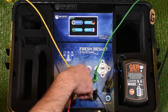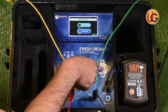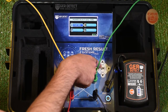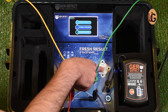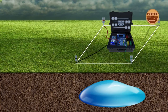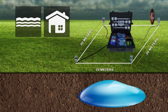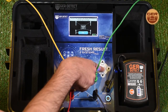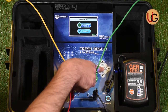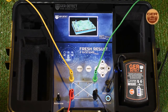Now we turn on the device and choose the search language. We go to device settings and choose the type of soil — sandy, clay, mixed, or rocky; clay soil for example. We then determine the distance between the four electrical ropes. It is recommended that the distance between sensors be 20 meters for accurate results, taking into account geographical conditions such as a house, a river, a mountain, or a fence. In such cases, you can search within 5 to 10 meters. We confirm settings by pressing OK then back, enter search systems, select Geophysical Search System, and the scanning process begins.